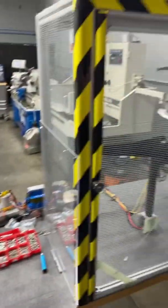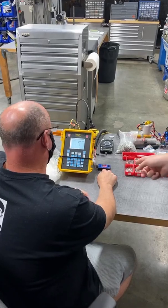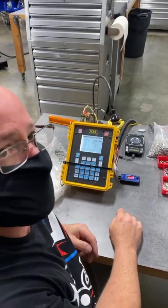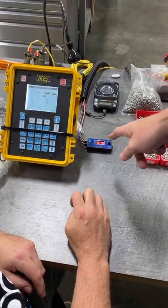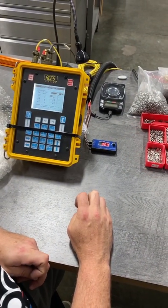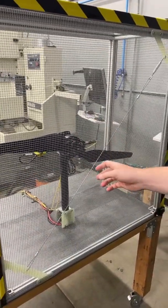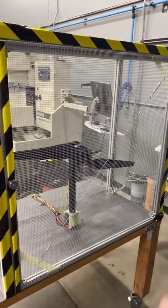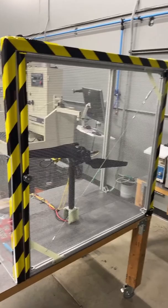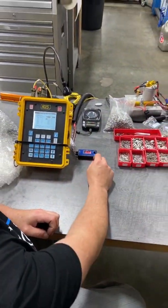What pulse width are you trying to get to? It's right around 1,567, but we want to get to around 2,100 RPM. This is just a servo tester — we're controlling a pulse width and that's converting it to an RPM at the motor. We have a set motor RPM that we're trying to balance for that is similar to the hover RPM on the Alta, to make sure it's dynamically balanced at the right RPM.